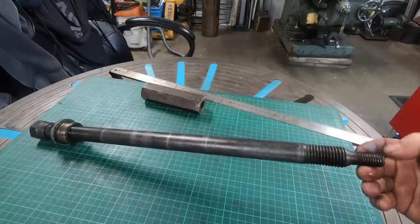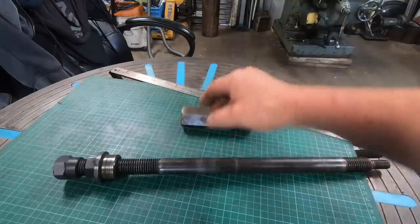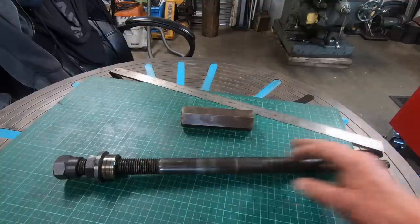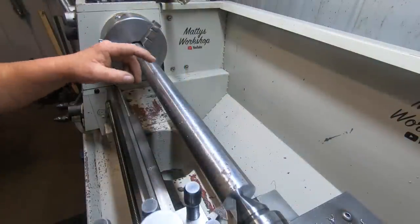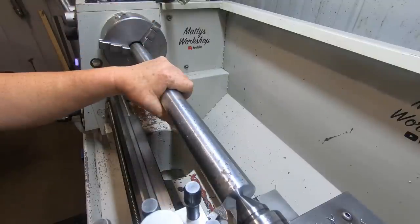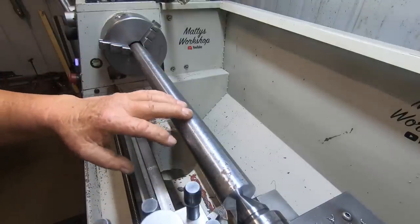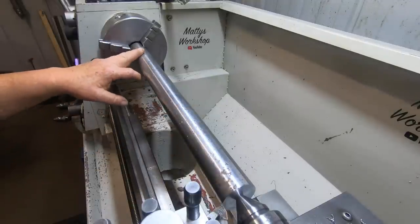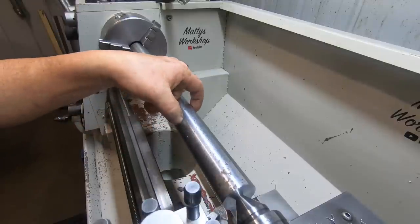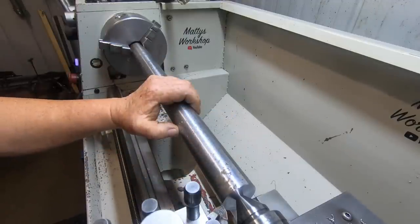I'm not too sure why they've got this tit on the end of it - I've never played with 50 taper tooling, don't know whether that's a necessity or not. The completely new drawbar just has a 24 mil thread on it compared to this one which is 1 inch 8 TPI. The material I've got is about 10 mil over length at the moment - about half an inch too big - but it's what I've got on hand. It's originally a piece of chrome bar that's been left out in the weather. I know it's a waste of material but I'm not going to buy a piece at current steel prices - they're way too dear. First off I've got to rough it down to 25 mil to start with.